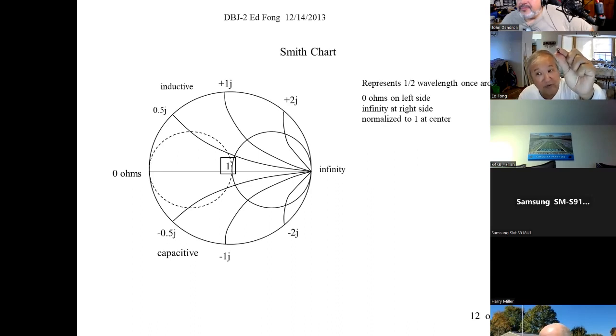But anyway, you tell people that's an open circuit coax. I'm not shorting it. So what is it on this end? It's an open circuit. No, it isn't. If it's an open circuit, it's not matched, just open circuit like that, and you put a network analyzer at UHF, which is about quarter wave, 5 inches, it's going to read a short. And if I short one end, it's going to read an open.